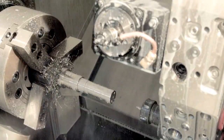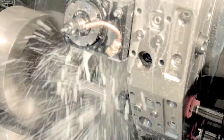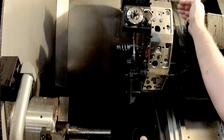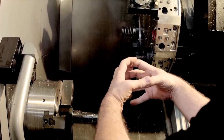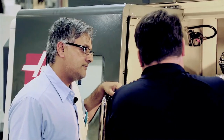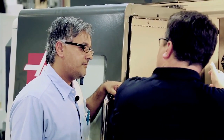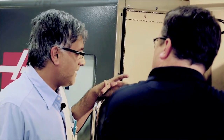Now we're running the live tooling. That is quick — you can see that it just barely moves enough to get the clearance. So what's happening is, instead of going all the way to that home position, I come out far enough so that my tools will clear the part, and then I start indexing. I'm actually uncoupling the turret while I'm coming to that position, because that's wasted motion — why not do the uncouple while I'm traveling away in a rapid move?